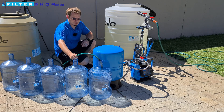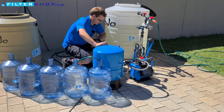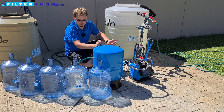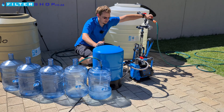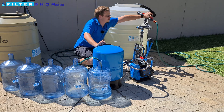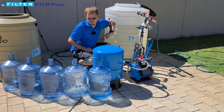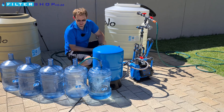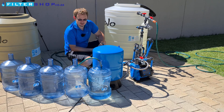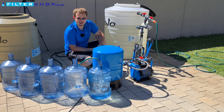The first one was four full-force fills and then we went to the slower fills. Immediately the difference is visible — the pressure pump hasn't turned on yet, so it allows the system to run quite a bit longer before needing to switch on. We saved one cycle there. For the slower draws, it won't consume any power while drawing from the tank, so we'll let it run quickly until the pump turns on, then slow it down to the same rate as the previous test.